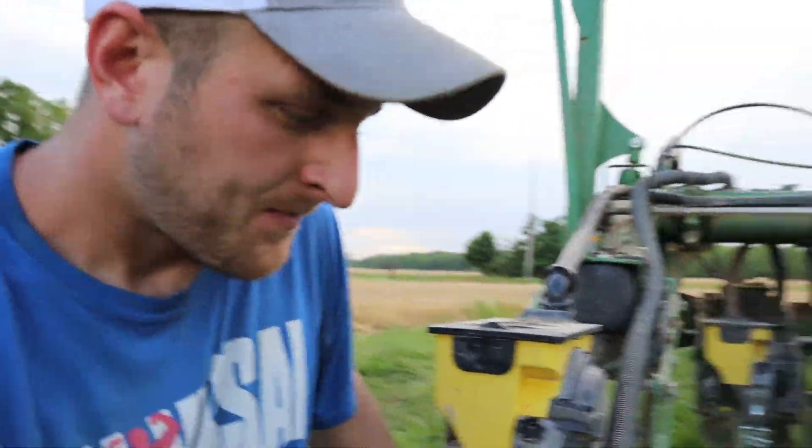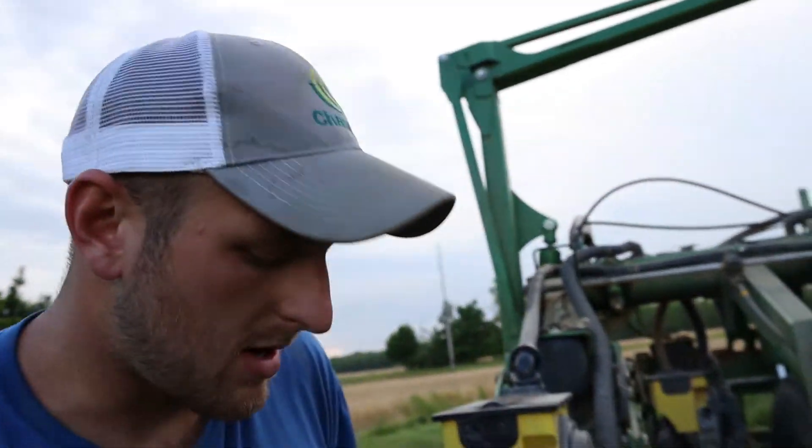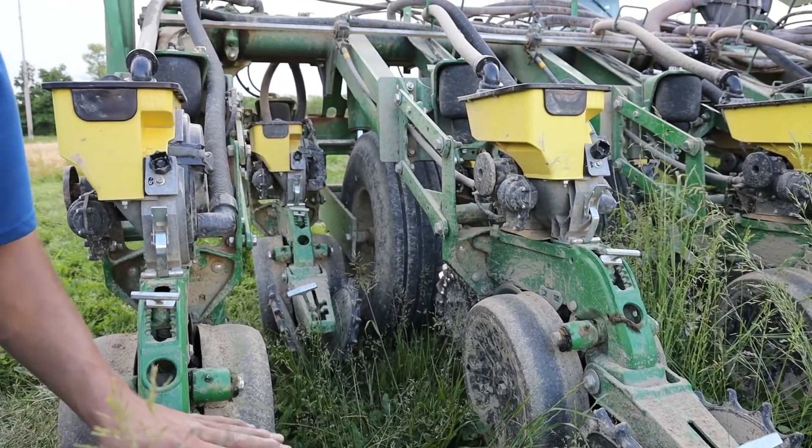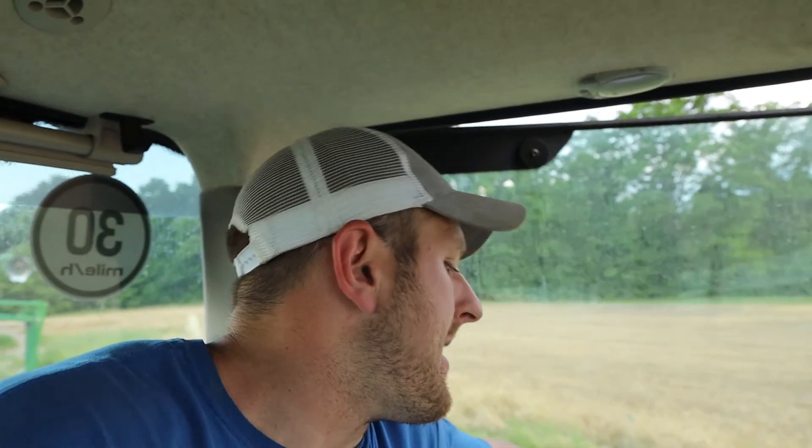Right here are the closing wheels — it's spring tension. These are Copperhead closing wheels; they really throw dirt right over the seed incredibly well. I've got this set on the second lightest setting. That seems to be doing pretty good behind this type of tillage tool at that depth — it's an easy adjustment. The main thing is just the depth. Some of you who have planted before are going to say, eight notches, two inches — that's really bearing into the ground, Jeff. Yeah, it is, but we're getting extremely dry. It's probably going to end up more like an inch and three-quarters to an inch and a half, which is acceptable for late-season soybeans. We have no moisture — it's wicked out of the first inch and a half of the ground, with no rain coming for four or five days. To give these beans a fighting chance and not have them dry up on top, I've got to get them into some moisture.